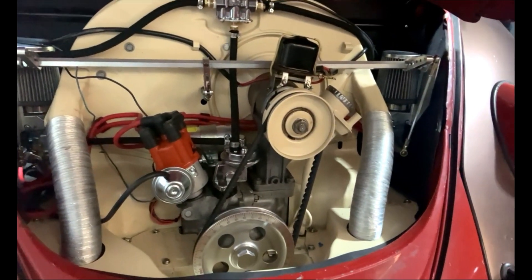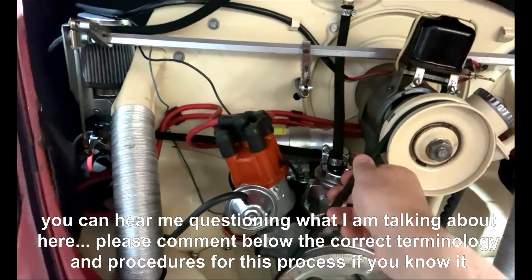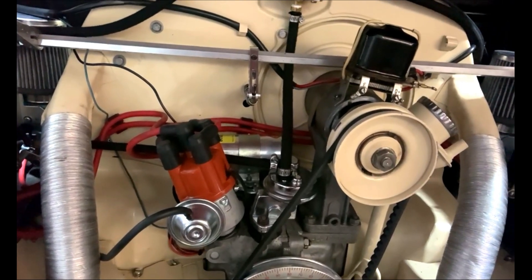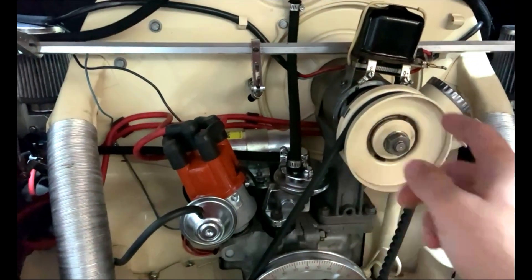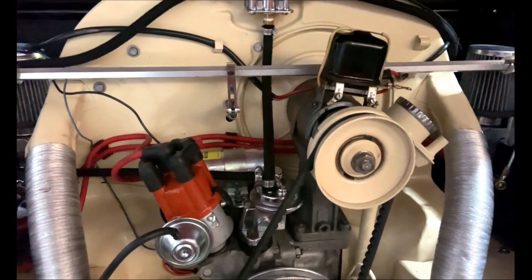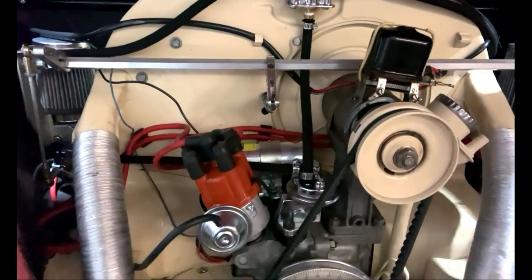So what I'm going to do now — something I learned today — is that you need to set the polarity of generators. What that means is taking the belt off, hooking positive to the positive terminal, hooking negative to the negative, and connecting that to the ground as well. Feel free to comment below if I'm doing that wrong, but that's the information I'm finding online. What that does is spin the generator to ensure it's working properly and also sets the polarity so that it will charge correctly — without that magnetism or charge, it just won't produce the output it's supposed to.